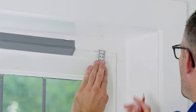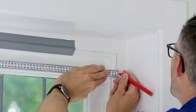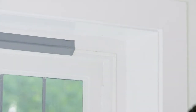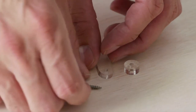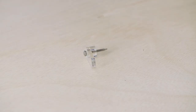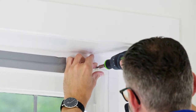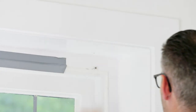After marking off the glazing clips at the corners, distribute the remaining glazing clips spaced equally apart, keeping a distance of 30 to 40 cm between the clips. Take the glazing clips, first remove the protective film from them, then assemble the glazing clips. Once complete, place the spacer against the sheet at the marked position so that it is clamped in place. The glazing clips should be able to keep turning, so don't screw them too tight.